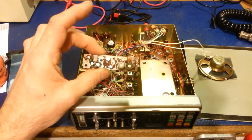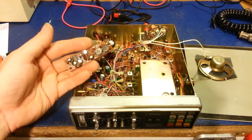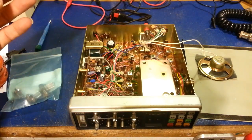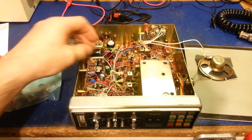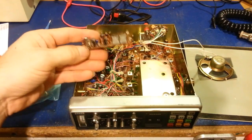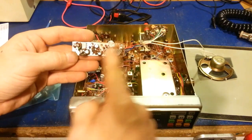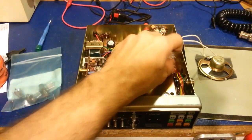This is actually the one out of this radio. At some point in time I got a bunch of these in a lot. Don't know why somebody removed them — I actually like them, I think they work really well. But I have a bunch of spares, and I had rebuilt all of the spares, so I know they all work. So it was just faster, for expediency. Because there's two coax cables — there's an in and out, a ground, and a power. That's another thing that's nice about these: they're kind of universal. You could honestly install this in any radio. Audio in, audio out, positive and negative — that's all there is. All the controls are on here: the gain and the compression level controls are right here. So I just stuck a replacement in. Works fine.